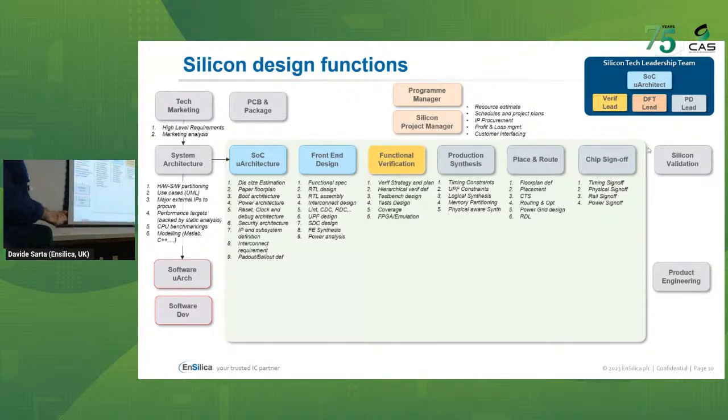You start doing a boot architecture. So this is not something that system architects will care about. The system has to boot, that's what they will tell you. But you have to define exactly how, from which external or internal memory. Do you want a boot ROM? Do you want an external flash to do the booting? Or is your CPU a slave, or some other agent which is off chip, which will download the bootstrap internally, and then after that you start. So there are many different ways of booting a system, and that's why it deserves an entire section.